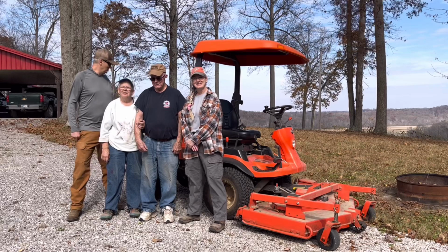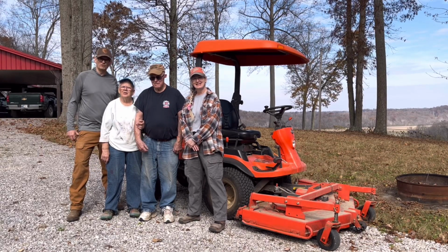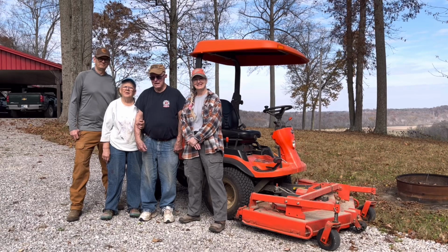All right, so that's our Kubota F3680 video. This lawnmower was overheating yesterday, and we got all that dirt cleaned out of the radiator, and that solved the issue. So thanks a lot for watching.